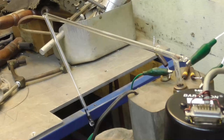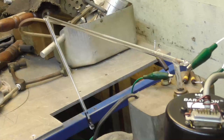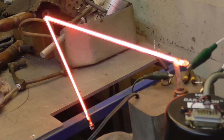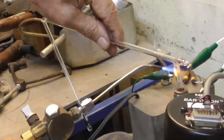I'm going to close the valve, open the neon, and get it in there glowing properly at 5 torr, and then immediately seal it off before air can leak in. Okay, power is on, and valve is off. Open the neon, and it's 2, 3, 4, 9, there we go, at 5. Okay, I'm going to seal it off right now. Okay, close it. We don't want the air to get in there.